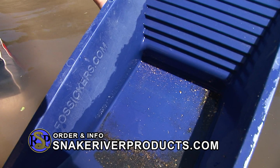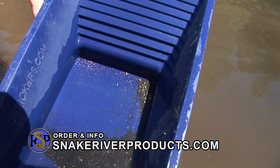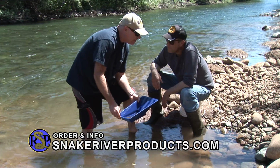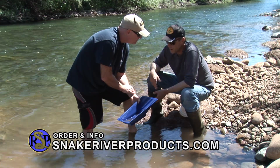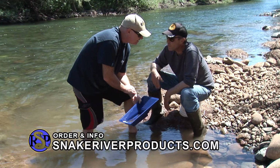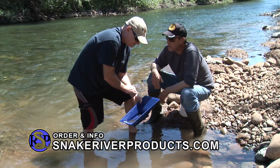All right, Kevin. Well, thanks for sharing that with us. That's a much easier way, or quicker way than I've ever seen to get gold, using a system without any carpet. Oh yeah, no riffles, no carpet. You just get the material classified down. I prefer 1/2 inch, but you can go 1/4 inch or any real classification in between, and you just run the material through.